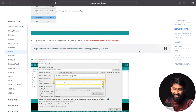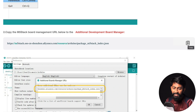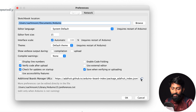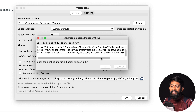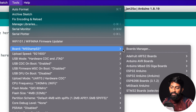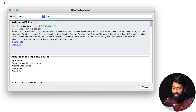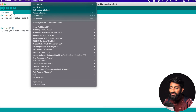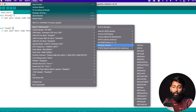To get started with using M5 Dial with Arduino IDE, you first need to install the M5Stack boards packages. Go to the boards packages page — the link is in the description — copy the URL, then go to Files > Preferences and paste that URL. Click OK, then go to Tools > Boards > Boards Manager, type M5Stack, and install the boards package. I have version 2.1.0 installed. After closing, you'll have support for all M5Stack boards in your Arduino IDE.